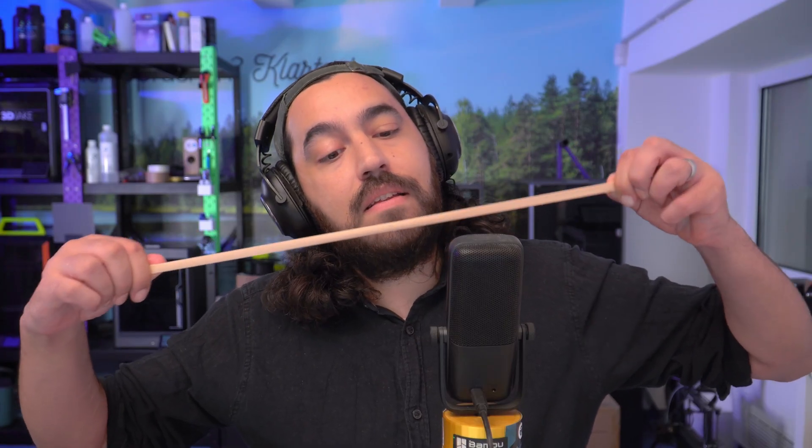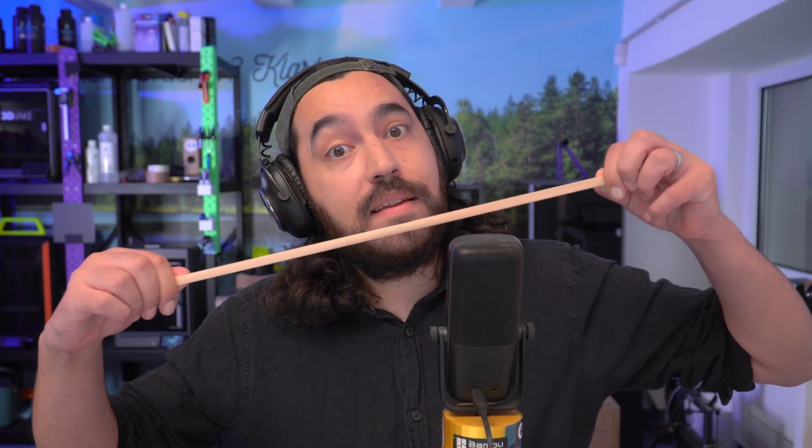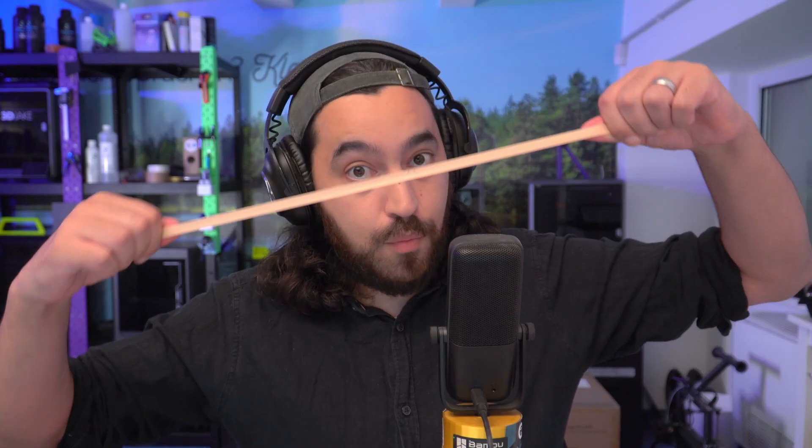That covers soft filament - what about elastic filament? There is a difference. While foamy filament is soft, it's not that elastic. We have a way more elastic filament: Recreus Filoflex 60A Pro. It is the stretchiest filament I have ever used. It has an elongation at break of 950% - you can pull on this and it will stretch up to 950% of its initial length without breaking.